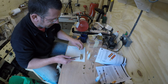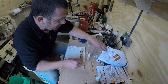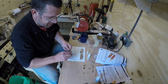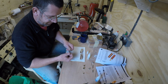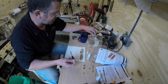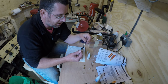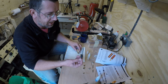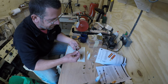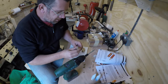That's the second one done, so I'm going to leave those to dry for a few minutes. The next job will be the barrel trimmer - I've only gone for the bog-standard one; for one thing they didn't have both in stock. The good thing about these is you can actually just use them in an ordinary drill because this center piece will go straight down the center to keep it square and flush.